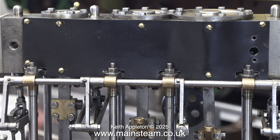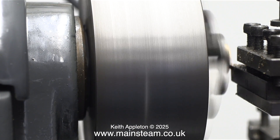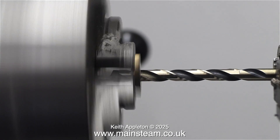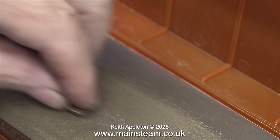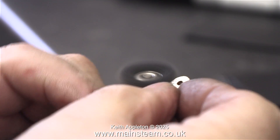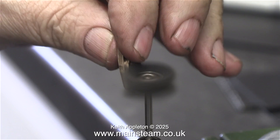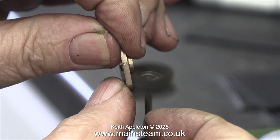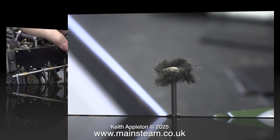I've allowed a bit of tolerance on the cladding to allow for the curvature of the mounting lugs and I think it looks okay. Over now to the first job using my Myford ML7R in the small workshop — I'm machining the bottom of the exhaust manifold to make sure it's flat, and here I'm drilling a quarter-inch diameter hole through the centre into which I will silver-solder a right-angled elbow. First, using the whetstone, I'm removing every trace of soft solder from the flange itself. After doing this I cleaned up the entire part using one of these rotary brushes. The exhaust manifold is a very visible part of one of these engines, so it needs to be right. I'm also going to file away part of the inside so that it lines up with the hole in the casting a little better.